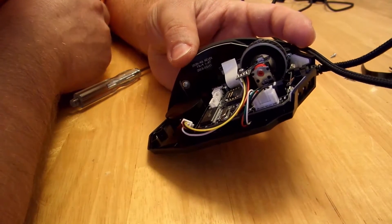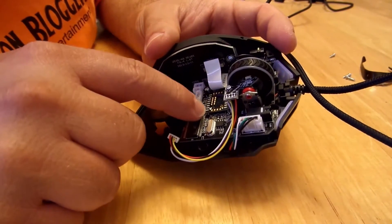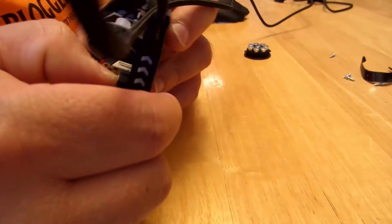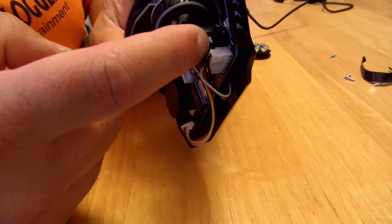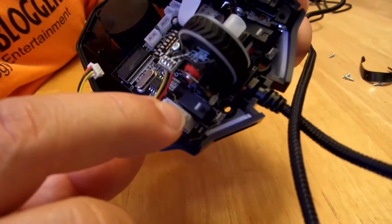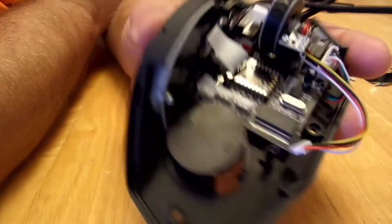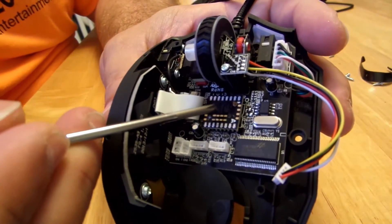That could be the Avago, although I'm expecting it to say Avago. I can't find that, keep looking. There is an 'A' on this chip. By the way, there's an Omron right here and an Omron right here — those are for clicking, those are for the actual mouse buttons. And then you move the mouse wheel — there it goes. So that's what the inside of that mouse looks like. Pretty sure that's the Avago chip, one second.